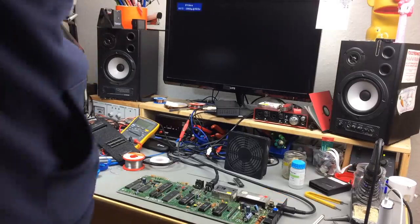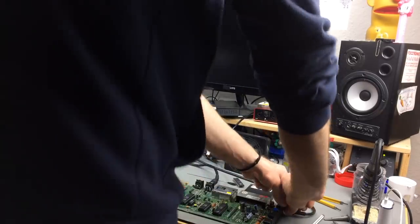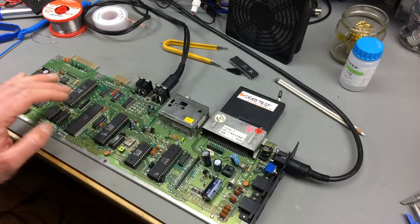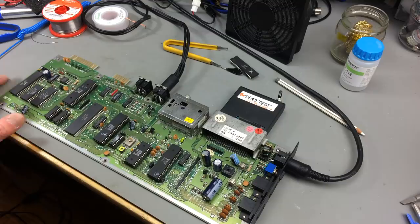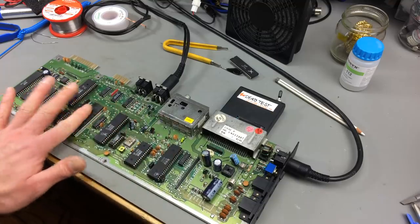Let's try if it takes the dead test cartridge now. Maybe it works a bit better. We can find out what the fault is. Come on. You can do it. So that was promising. The CIA was damaged, so I replaced it with this one, that is the known working one. I'm also going to replace the second CIA, because if this one's shorted, it might as well give us a blank screen. Yeah. Then it might also be the RAM.